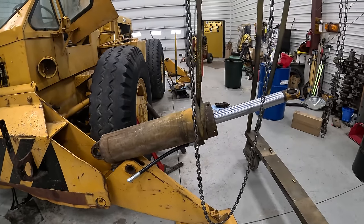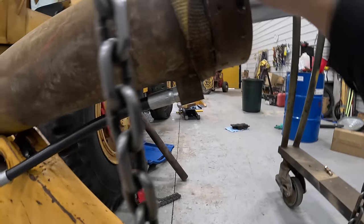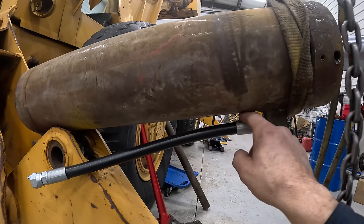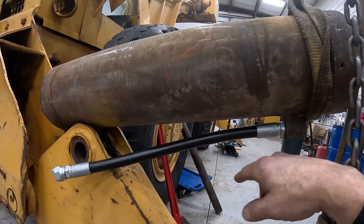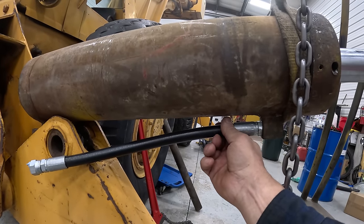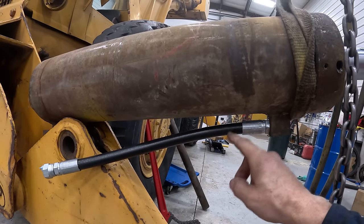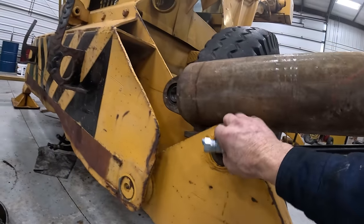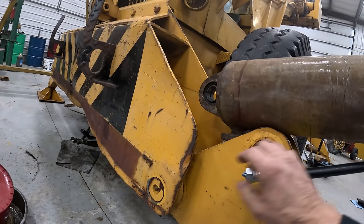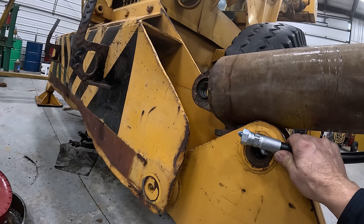All right, so I have to put the nylon strap clear up front behind this block here for the hose, because you can't really get it under here and get it back out once it's in there. On some of those other ones, I wrapped it around here and pulled that hose. Anyway, it cracked the hoses because they were swollen, but I don't want to damage this. This end screws to the check valve that bolts to the back of the barrel here, and there's just enough room in there.